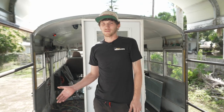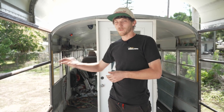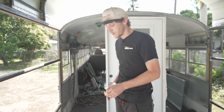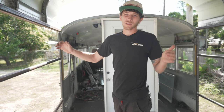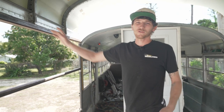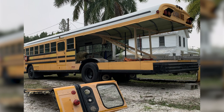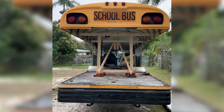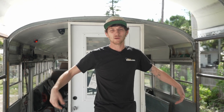After that, I needed to get my sides cut, so I looked at what they consisted of inside and out to be able to cut them away. The first side, being a test piece, took a lot longer, but we managed to cut it in two cuts inside and out. Before we cut the sides off, we had to support the roof. So we rigged up a tranny jack and two floor jacks, and built a wooden structure supported between the bracing on the side that is riveted to the complete top and bolted to the reinforcement pieces above. Once that was all set in place, we were able to cut the sides completely free and raise the roof.